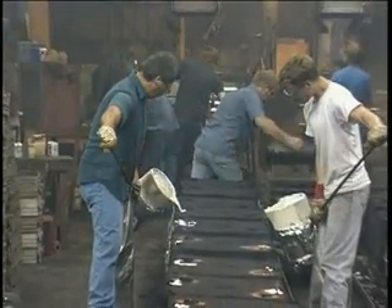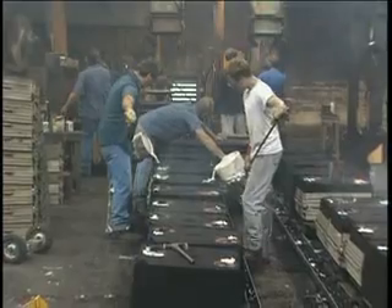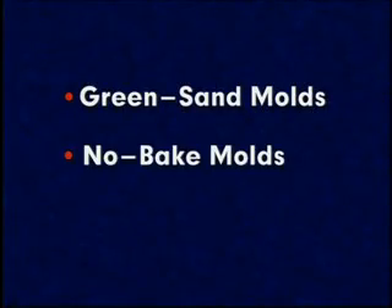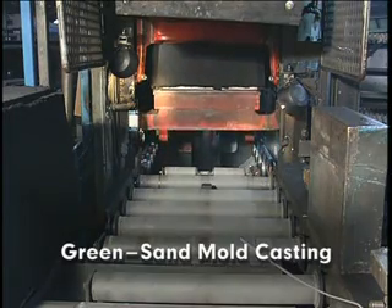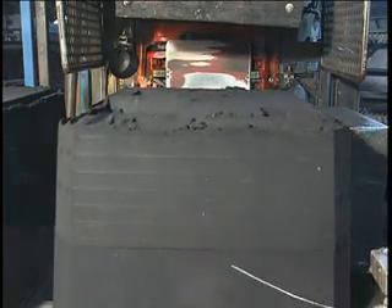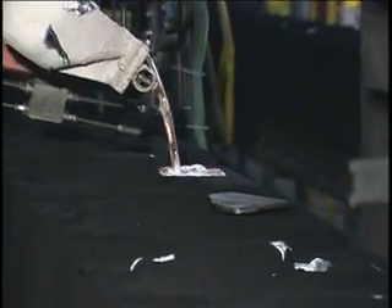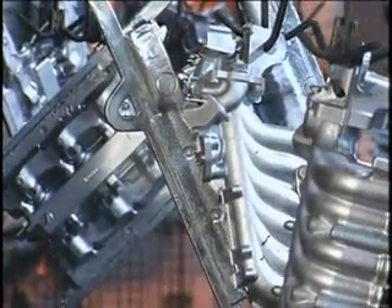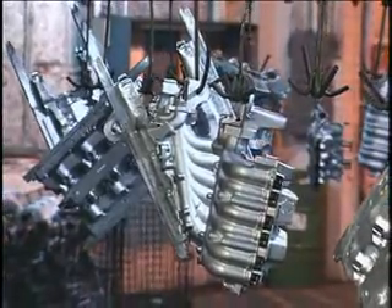Casting in sand molds is classified based on the type of sand used and variations in the mold making process. These variations include casting in green sand molds, no-bake molds, and in shell molds. Green sand molds are made from a flexible mixture of silica sand, clay, and water. The sand is said to be green because of its moisture content. Although casting in green sand molds is a versatile process, thin sections are difficult to cast because they may be eroded by the molten metal, or the metal may cool and become solid before filling the sections. Also, part tolerances and machining allowances must be rather liberal. Very smooth finishes are not attainable, and certain metals can develop defects if cast in molds that contain moisture.